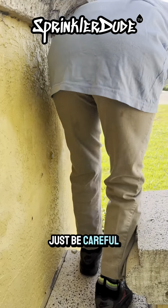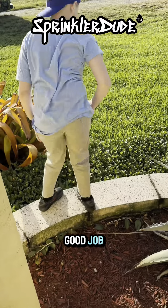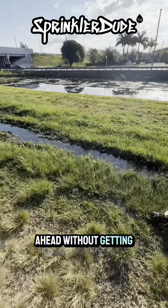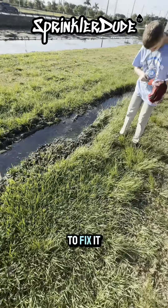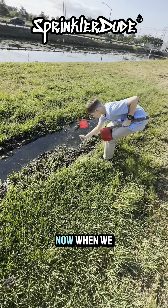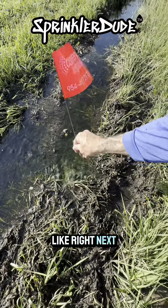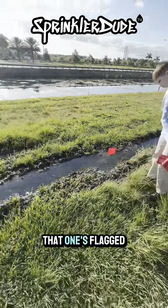The water source in this case is called Reclaim. There is no backflow here, so we can skip this. There's also no pump here because it's reclaimed water — it's being pumped into this property by the city, so we don't have any of this to worry about. There isn't a rain sensor at this site because they're using Hydrawise only as their rain sensor. If they had one, it would be better because then they would know if it was raining at this site and not just at the weather station — but that's a story for another day.